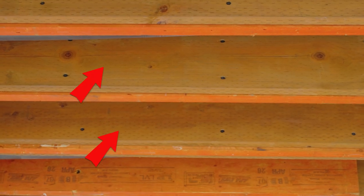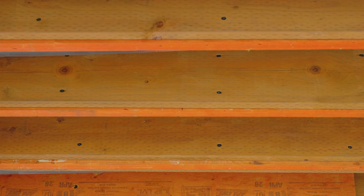The pressure treated hemlock with all the incisions in it, that's the part that we added. The LVLs stuck out of the house six feet and they're 16 inches on center. Those LVLs go 24 feet back into the house and then they cantilevered six feet out past the house. It was very structural, almost over-engineered, because these LVLs are about an inch and three quarters thick — they're like 12 inches wide. So they're inch and three quarters by 12 inches, and I was holding on just one of them trying to get some deflection out of it and I didn't get a whole lot of deflection.